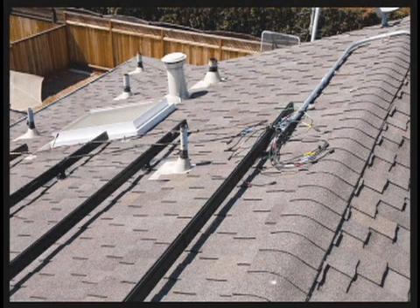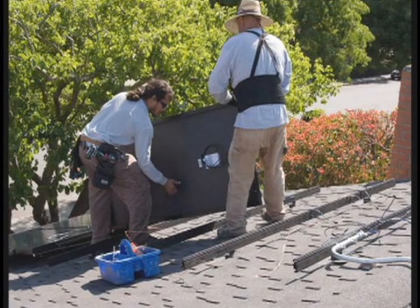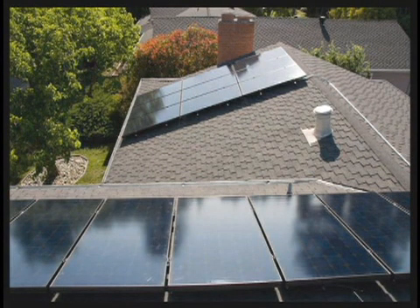Aside from the racks, all the wiring is concealed within the racks themselves, and then you have conduits that come out and run along the roof and then down to the ground — tidy looking. This is a SunPower 225-watt solar panel; the guy standing next to it gives you an idea of how big it is — it's a decent-sized panel. They're starting to lay them into the racks. This is the south-facing roof, which will have nine panels altogether. The west-facing roof will have 18 panels — two rows of nine. You can see the nine-panel rack from the top of the roof, just above the 18-panel rack.